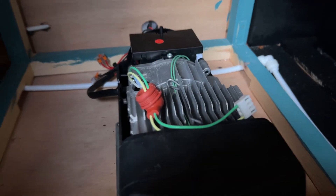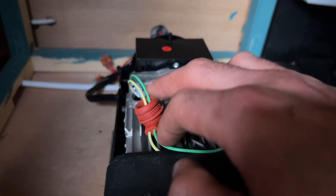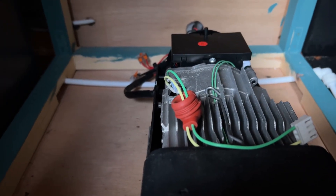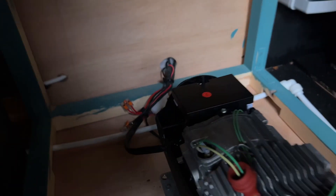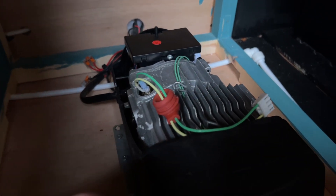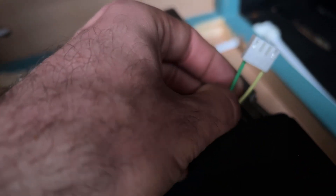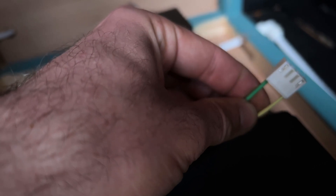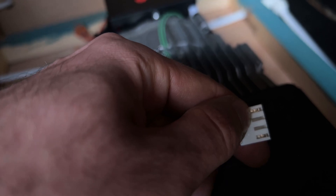Looking inside the cupboard here at the diesel heater, you're going to take the top cover off and you'll see this cap here. You can actually take that off if you want to but you don't need to. I've disconnected it from the unit back here — it's just got a little clip so you can take that off, and that's probably the simplest way to test it. The green lead here would be the positive and the yellow lead there is going to be our negative.